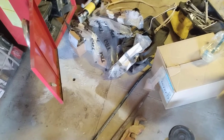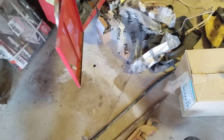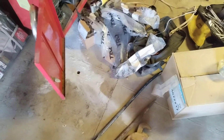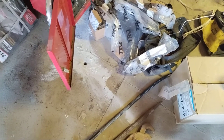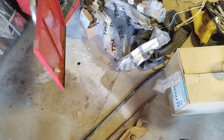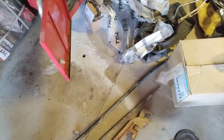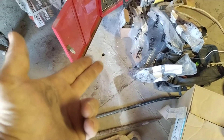With epoxy, it won't cause that fracture. Ultimately you get to reuse the hole again if you do get some failure — you can get that anchor out of there and drill out the epoxy, which won't be an easy task, but you'll get to reuse it. It typically does not make a fracture in the concrete. I put it near the edge so you'll be able to do some extrapolation.